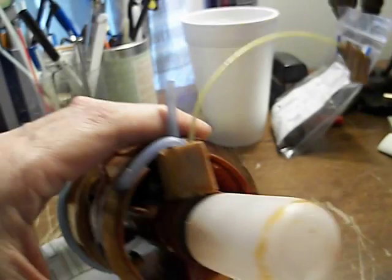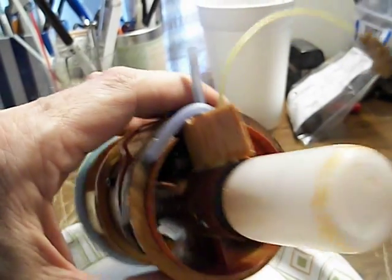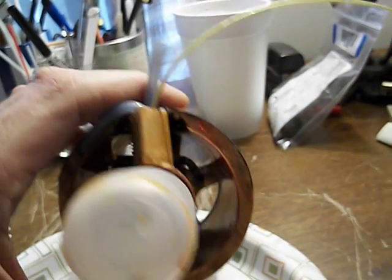It's plywood formed, with formers to keep it round — I think that was one sixty-fourth inch ply. It's perfectly round. I tried to keep the tip losses as little as possible, so I've got pretty tight clearances. Let me see if you can see it through here — you might get a better idea of how close the tips are to the shroud.